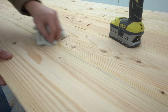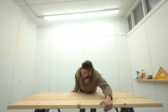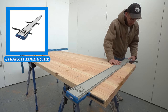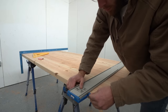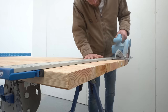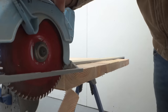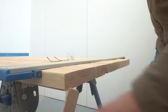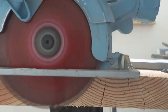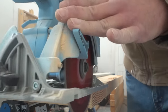After I cleaned all of my seams I let the glue dry a couple hours before I flipped it over and prepped to cut it square on the ends. This tool has built-in guides that allow me to measure and mark the line I want to cut and then move them out of the way before I take a pass with my circular saw. Pro tip: pine does have a tendency to tear out so taking multiple passes helps. You can also put painter's tape on your cut line to prevent it absolutely, but ultimately nothing is better than a new finish blade.